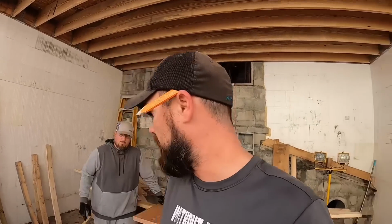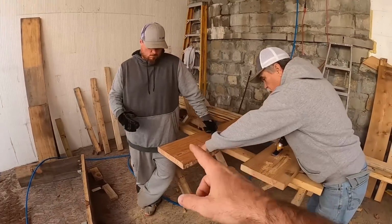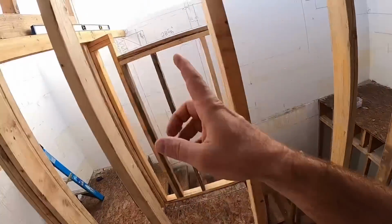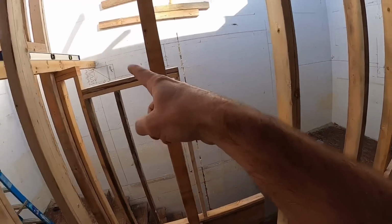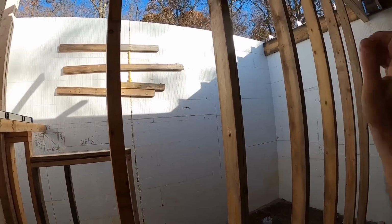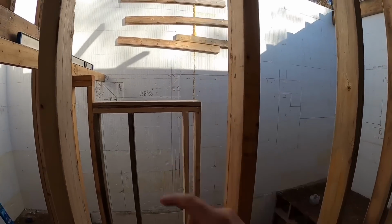We'll actually be able to put joist hangers on a header and then screw in the tails of those joists to make sure this is good and solid. So they're gonna notch all of the joists that go that way, and then we're gonna start mounting up this platform back in place and connect that stringer to get to this platform, and then start figuring out the second platform that'll attach to this wall and carry over to that wall. So let's get some framing done.